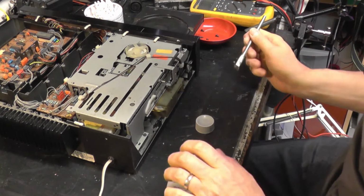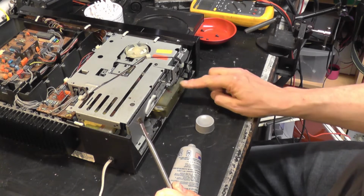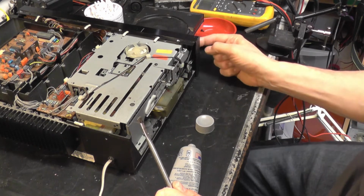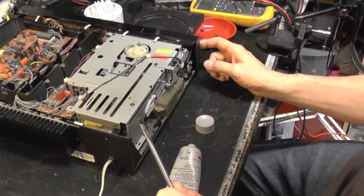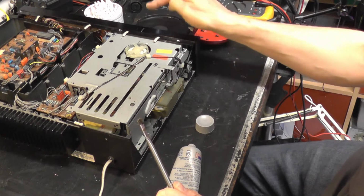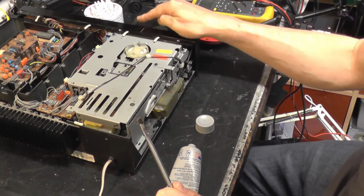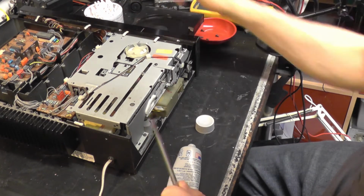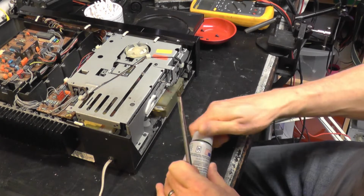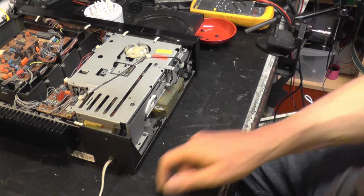I get free postage. One thing I ought to point out if you're doing this lot down here is the main switch. So pull the plug out of the wall. I have done. Right, I'm just going to spin it upside down, and we're going to clean that rack that's under here. There's a rack and pinion sort of arrangement, and we're going to re-grease that as well. So let's do that.